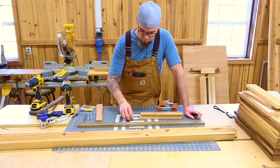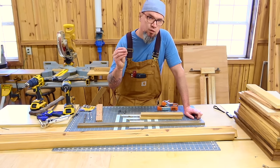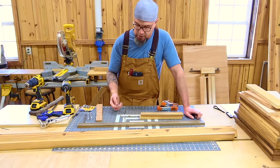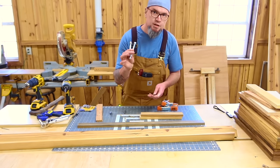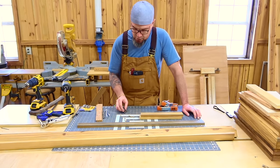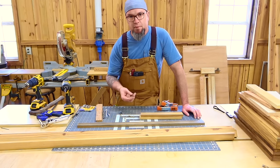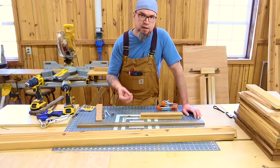As far as hardware goes, you're going to need one-and-a-quarter-inch deck screws — these things will not rust like regular wood screws. I like to use the star-head deck screws. You'll also need two bolts for the bottom: three-eighths-inch bolts that are four inches long. You're going to need a three-eighths-inch drill bit, and because we pre-drill and countersink all of these, a combined drill and countersink bit, or you can use a drill bit and a countersink bit separately.